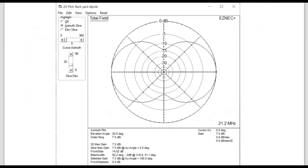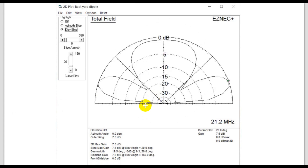Now I know that the textbooks — both the general and extra class license manuals — say that a dipole is 2.1 or 2.2 dB above an isotropic radiator. That's true in space where there's no ground involved. The problem is there's no place on earth you can do that. So you end up getting a bifurcated vertical field like this one right here. This is the backyard dipole, put up at 35 feet, and notice how much happens up in here. You bifurcate the field because it's too high for this dipole.